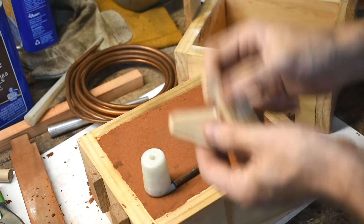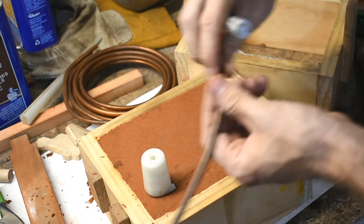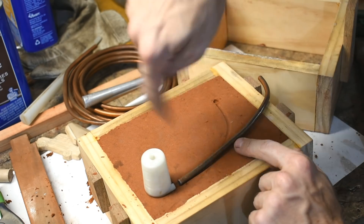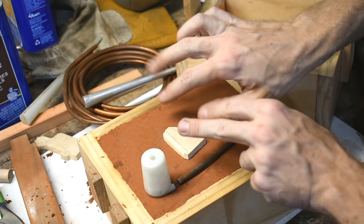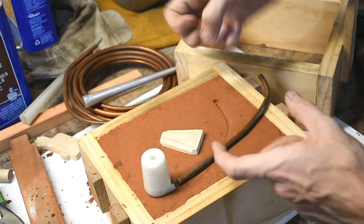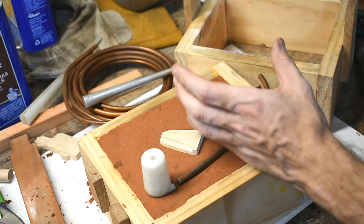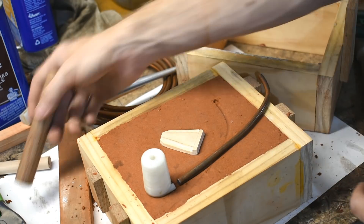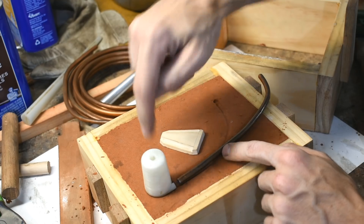That's bad. You slow it down into your pattern with the tapered sprue former. It goes around your nice, smooth, even diameter — the smoothness is important, you don't want huge changes. Then it rushes into the surge trap and overflows slowly into your part. This way you don't have that rush carrying any sand or oxide layer bursting through your part. You also don't end up with turbulence mixing air in as you pour. Imagine dumping water into your glass — there are still air bubbles mixed in because as the water hits the bottom it stirs up all the air. That crap gets mixed into the metal and gushed through your part. With this setup it goes straight into this, minimized by the tapered sprue former, and then all the rest of the air goes in here. It's a magically cool thing.